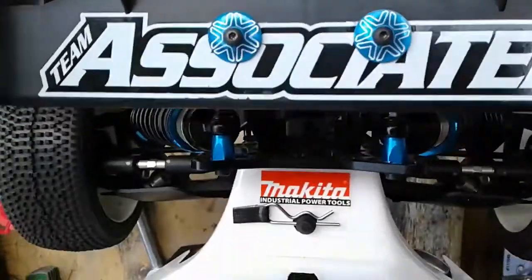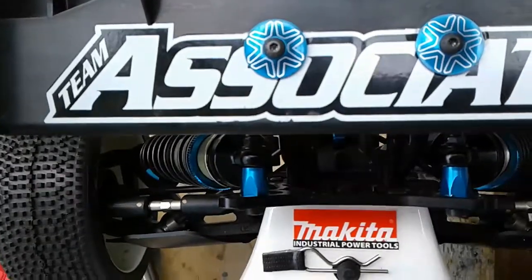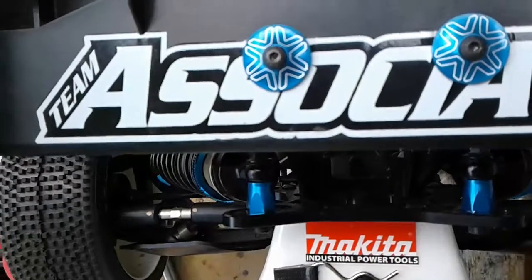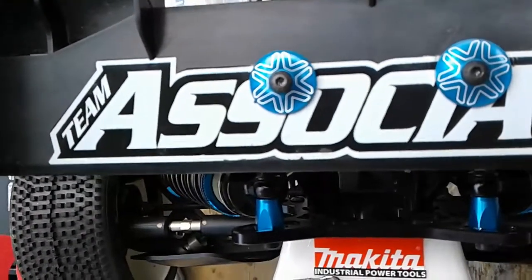So I just ground about 2 mils, 2 millimeters, off the end of the screw. You just thread a nut over it and put it on the grinder, and take the nut off and it'll clean your threads up on the end.